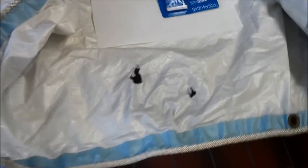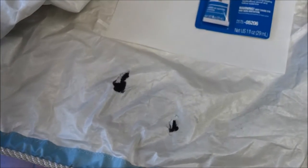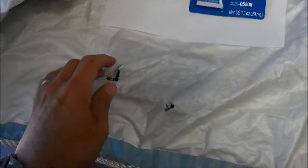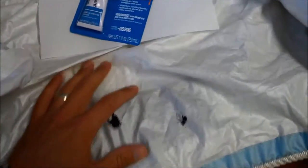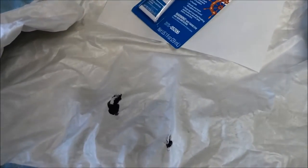I have a tear in the mainsail for a 17-foot sailboat, and the rest of the sail is in really good shape — it's just these two small holes. I saw some folks online that have used a piece of Dacron and some 5200 in place of stitching patches on, or using sail repair tape, so we're going to give that a try.